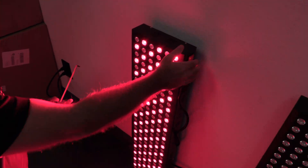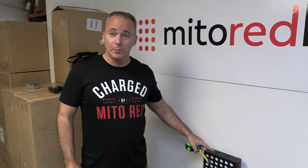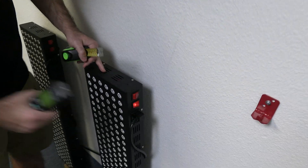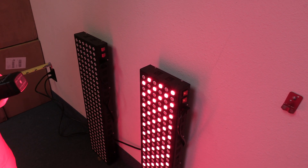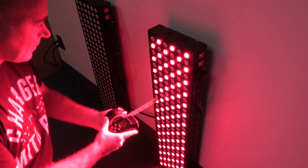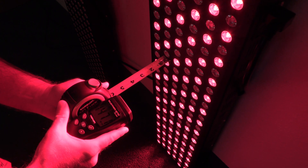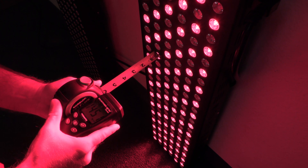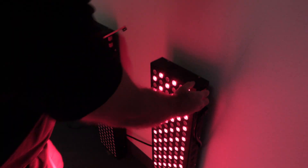Okay, not 103. Interesting. Just to be clear that there's nothing special about this particular light, we'll go ahead and measure this other unit. Again, two switches — near infrared, which is actually invisible, and red. Let's come down to the middle of the light. I'm pretty consistent here — 147, 148 milliwatts per centimeter squared at six inches. So not quite 103.